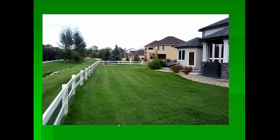That black pipe kind of in the top picture that's extending out, that is a sump. So that is going from the basement of the house, collecting any water from the foundation and pumping that back out. Then there are some vents, whether the dryer vents, heating vents, things like that. And then there's a downspout coming down next to that. That's actually going into a pipe underground. So we always want to note that. The bottom picture is showing some AC units, and again with the downspout.